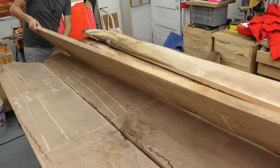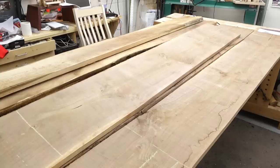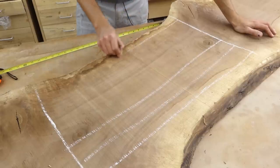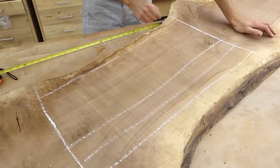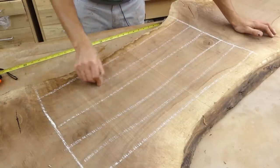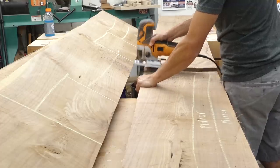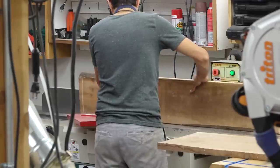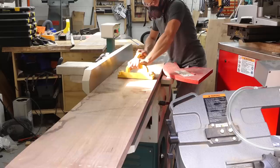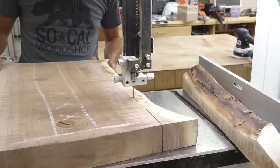The desktop boxes came out of a clearer section of one of those boards. I also have a bunch of secondary material for the drawer boxes — that is silver maple, leftover boards from when I built my workbench. And then lastly for the layout are the legs, which came out of a piece of the eight-quarter stock to give me the thickness I need for my leg stock. With all my parts laid out, it's time to run through the milling process and get these things broken down into actual parts, especially with the longer boards which are 11 feet long.